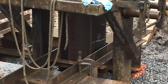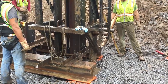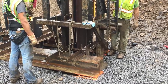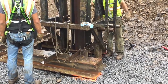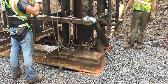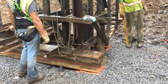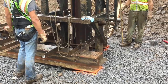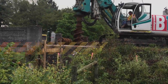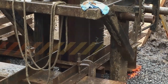Some final points to remember: 1. Be familiar with the proper paperwork. 2. Review the plans, specifications, and contract documents. 3. Inspect materials and equipment prior to use. 4. Check foundation depth before driving piles. 5. Maintain communication with the structure control engineer. 6. Ensure piles are driven to driving criteria and meet final tolerances. By following these steps and working safely, you will greatly increase your chance for a successful pile installation on your project.